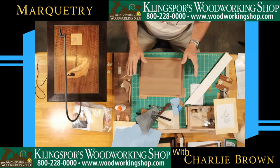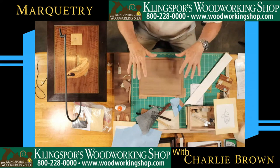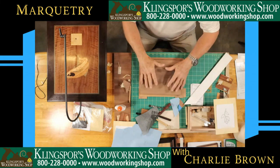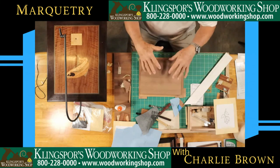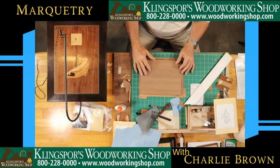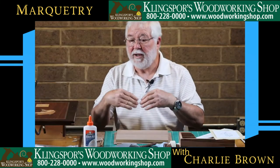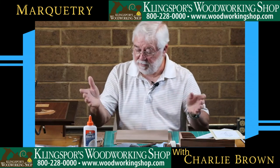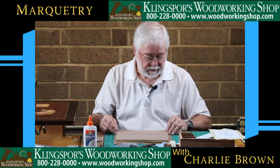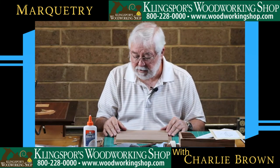Glues. I use contact cement simply because I don't want to get involved in a pressing situation where you've got to have a bunch of clamps and cauls, and you can use a vacuum bag, and I've done all of that, but the contact cement is easier and quicker for me. Typically, I do several pictures before I get to the glue up process, so I don't have to get all that out and mess up a lot of materials. But anyway, that's pretty much the process.